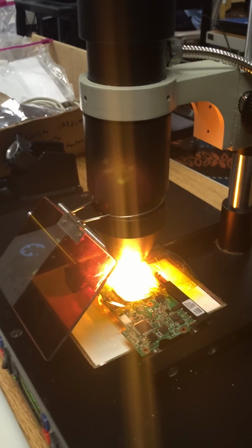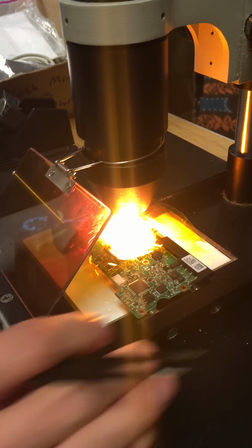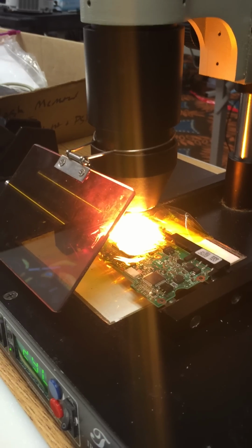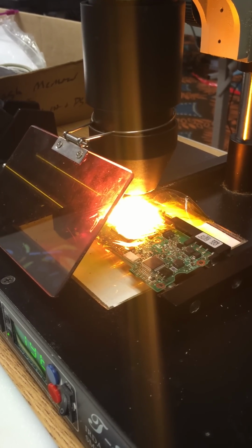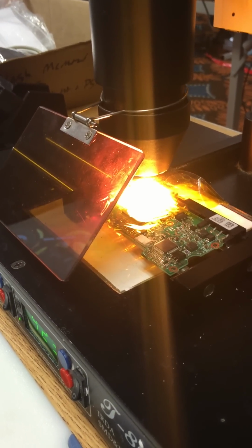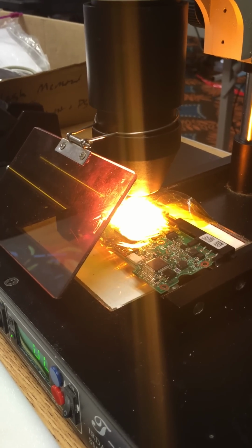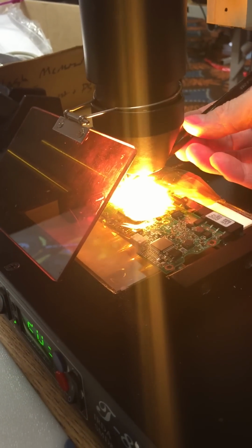Now, that's going to start frying the chip, and it's going to take about a minute and a half. Now this chip can take a pretty good beating. It pretty much survives almost anything. But other chips, like a CPU, you would want to have this at a pulsing rate. If the temperature is lower, the device will pulse instead of doing it all at once. That way the temperature doesn't exceed what the chip can take before it falls apart. So you may need to practice with another board to make sure you have the temperature low enough. Otherwise, we're just hammering this one at 100% as we can. It will do damage to a CPU, but a ROM chip will probably survive any of this.